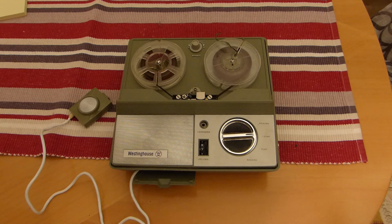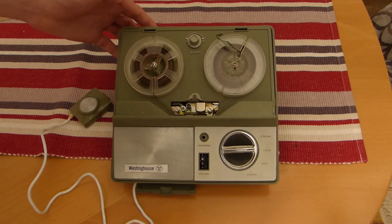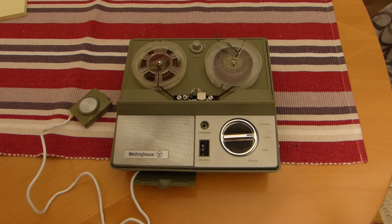I also had to replace one electrolytic capacitor which had gone open circuit. It was the capacitor coupling the magnetic head to the rather simplistic 4-transistor amplifier. This actually only uses 4 transistors — two transformers though.